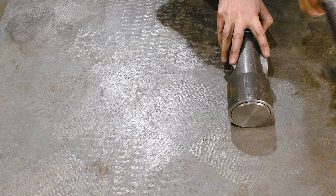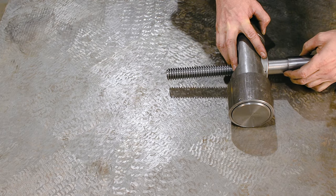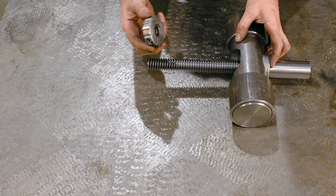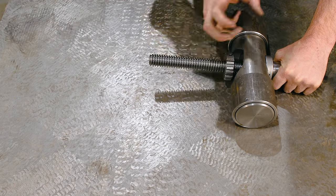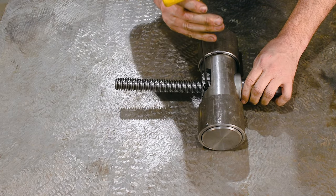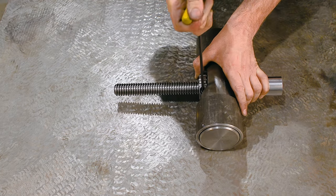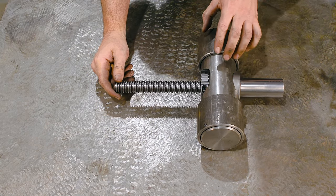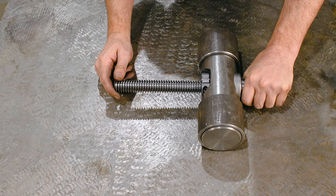And then it all gets contained with this left-handed screw. And then to hold all this in place is a left-handed locking nut. And this locking nut has a lock screw to hold the backlash and keep the pressure just where I want. Okay, now the screw can't come out and it locks the bearings into place. And this solves problem one that I had, that the handle stays in the same fixed location and doesn't move when the spindle turns.